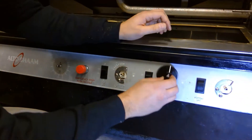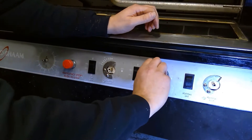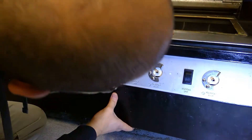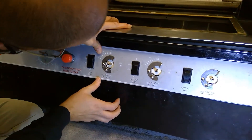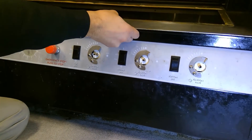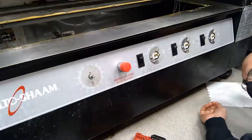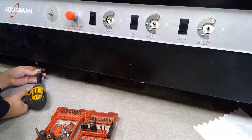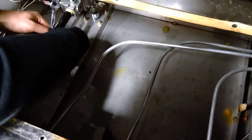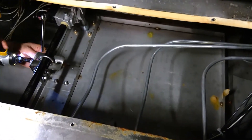I'm going to start reassembling. First I'll just test the operation quickly — make sure they're not stiff or anything. Good, we're in the correct position. Now I'm going to start putting all the outside bolts back on and tighten all those up. You still want to leave the gas train loose — you can still break these if the gas line is tightened. Once that's done, go tighten all the bolts on the gas line and make sure everything's good and tight.